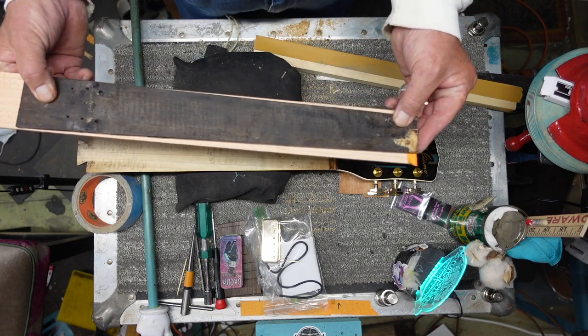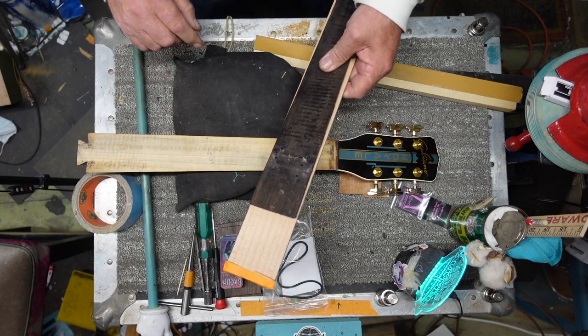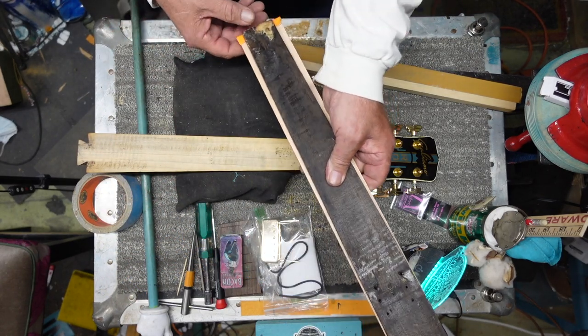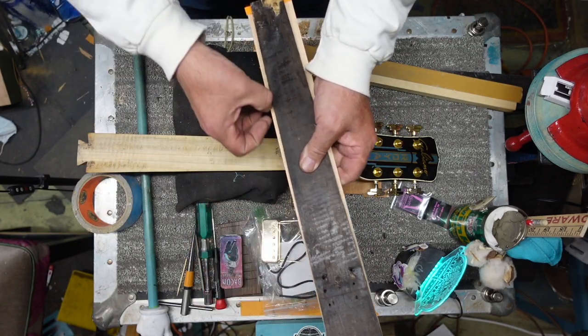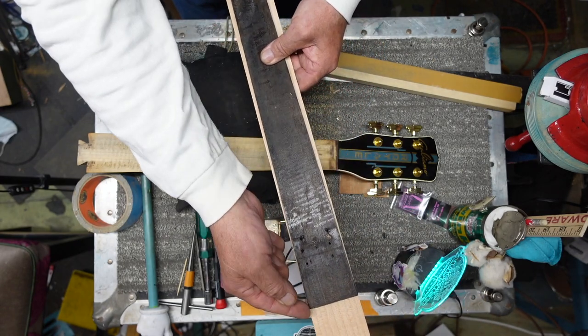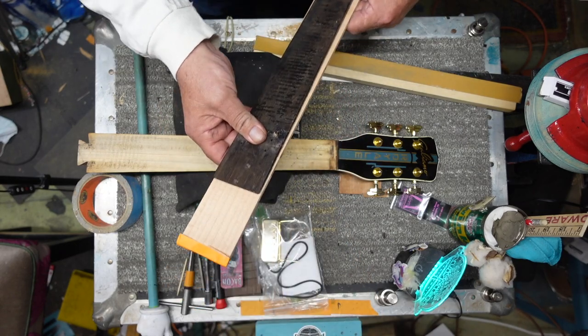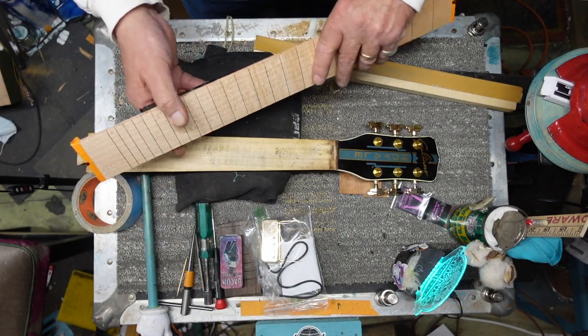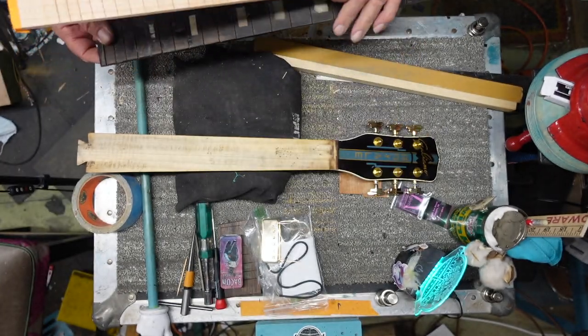Anyway, you can see how that is, a little bit sticking out here and there. With the double-sided tape, you can go to the bandsaw, and instead of trying to freehand a line here, you can use this as a guide and run the blade of the bandsaw right to this and get a nice even cut where everything is exactly as it was here on here.